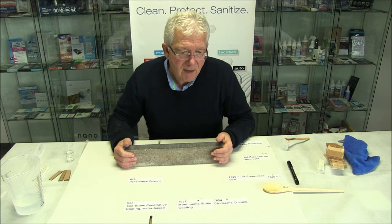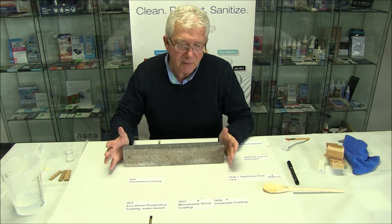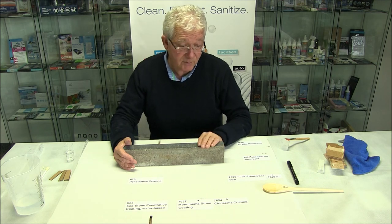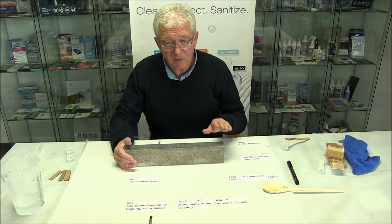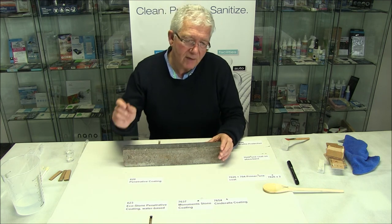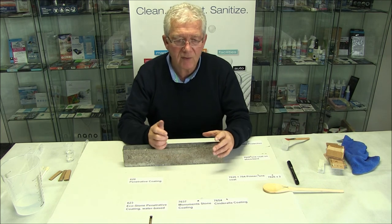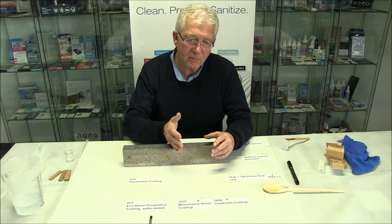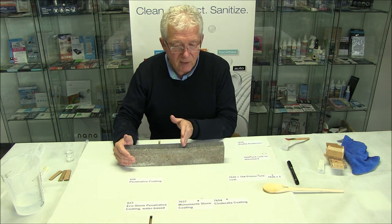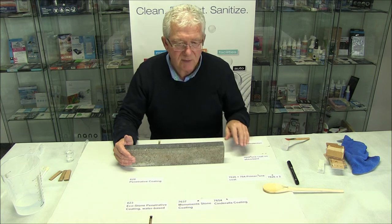The next guy comes along and says, the local council will not allow anybody to use any graffiti chemicals. If we're a green council, we just have to be able to clean with water. Okay, we only have one option, which is a great option, which is our 7626. So the graffiti will come on, you put the 7626 on, people come along, they do the graffiti every night. The next day, somebody comes along with a bucket of water and a microfiber, or if it's thick paint and it's been on for a few days, you might need to use a pressure washer, and that will remove the paint. So there is the only option there. If you can't use any sort of chemical, even if it's just bioethanol, then it's our 7626.